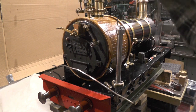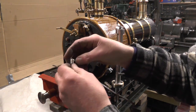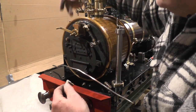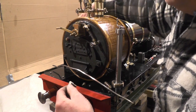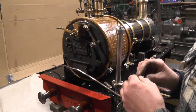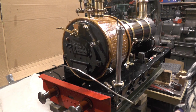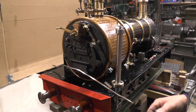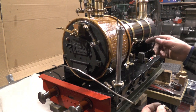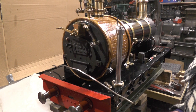On this side, in the front of the boiler, I've got to put the elbow in the smokebox for the blower. The blower pipe is going to come off one of these valves, come down here, come through the cab at the back, and follow the boiler down to the front. That's all I'm going to concentrate on for the moment. Like I said in one of my earlier videos, it's no good overloading — just take one step at a time. Once I get that done we'll move on; I can probably put the cab back then. And then we'll move on to the hand pump, balance pipe, all the other water pipes, and still the oil pipes to do.